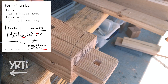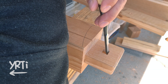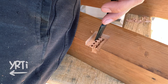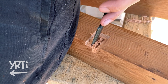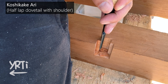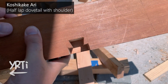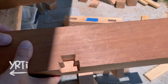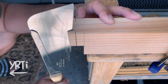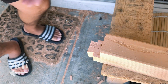Since I'm not great at using a hand drill, the square shape is easier for me to align the location. It's a long way to cut all the joints. Now I also do a half-lap dovetail with a shoulder, which I believe is called koshikage-ari. It's a smaller joint so it was a quicker job, but again I cut eight of them. I think it's overkill strength-wise, but I took it as a good opportunity to learn more woodworking. By this time I felt my saw-cutting accuracy had improved and I could cut just a few slices away from the marking line, even when cutting diagonally.